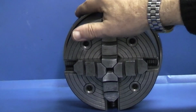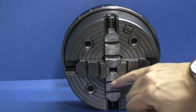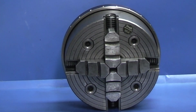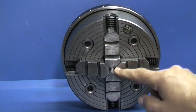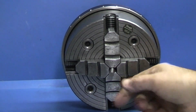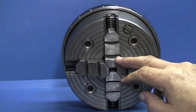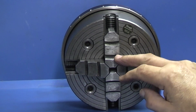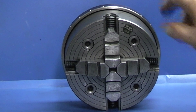The problem I had the other day was the chuck will only close that much because of the jaw interference, and I wanted to use it on a piece of silver steel. As you can see, that size won't grip on the chuck. To overcome that, I put an ER32 collet block in here, held the block, and then put the silver steel in the collet. But what I want to do is convert this ring on the back so that it will fit on my three-jaw chuck.